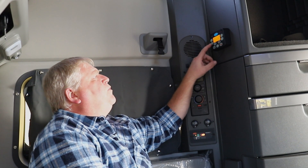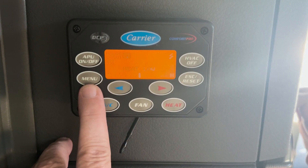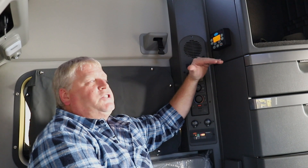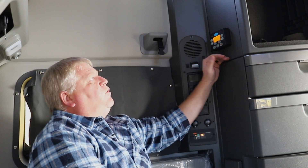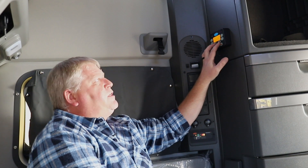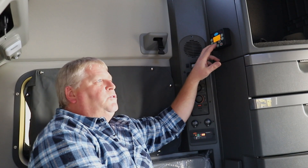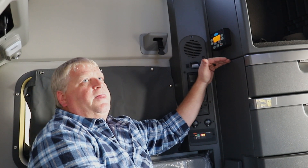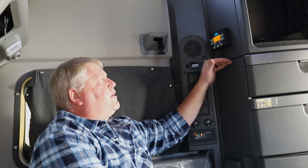Secondly, we are going to scroll through the menu, which is the button right below the on-off, and it's going to allow you to calibrate voltage for charging the batteries of this particular system. So for calibration voltage, you've got your plus and minus. You can adjust that down to 12.2 volts or up to 13.2 volts, and that will maintain battery voltage in your tractor.